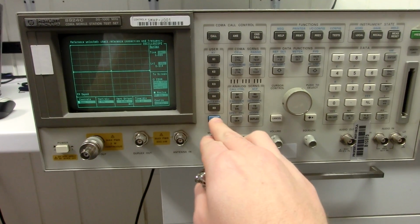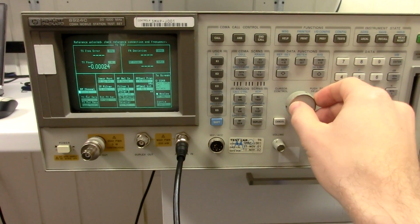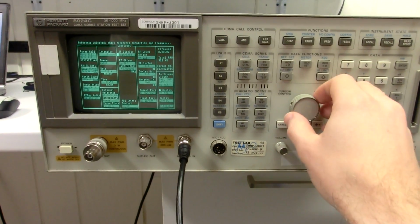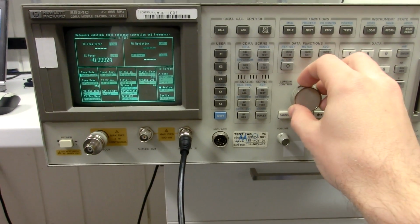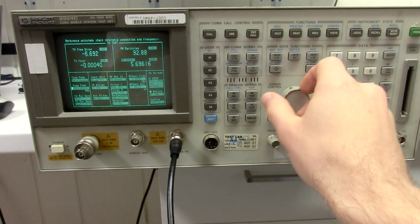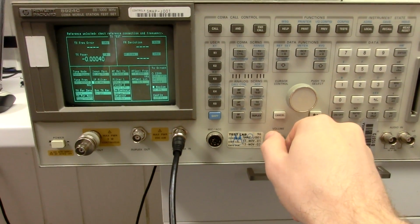So let's do that. I am going to just plug in an antenna, do a TX test, and let's do this. The RF, I'm going to change this to frequency. And let's go ahead and tune to a station here, 101.9, so there's that. I do need to change the IF. I'll turn the volume down. Change the IF filter to 230.